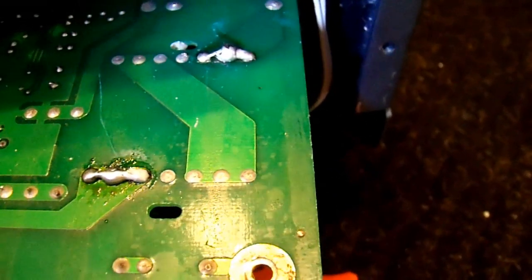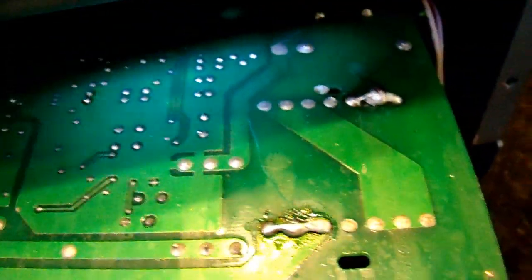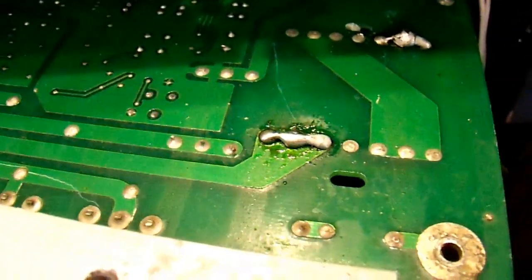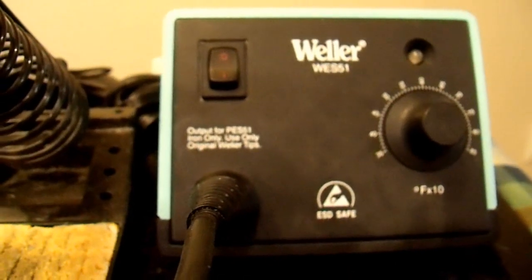The inductor has been re-soldered — just blobbed some solder on there, at least as good as it was from the factory. I'll also adhere it down so it doesn't come loose again. I'm using a Weller solder station — for something like this where there's this much heat sinking, it's really difficult to get a good solder joint unless you have enough heat, so a temperature-controlled iron is almost necessary to do it properly.